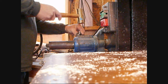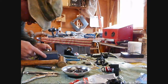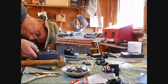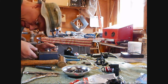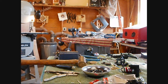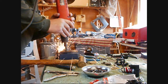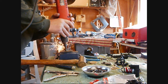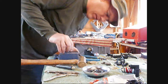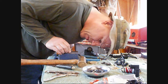If you were to drill it too large there's no friction — it's got to be slightly undersized. This is a number six tapping bit. That works — using the brass hammer so it won't damage the pin. At this point I can still nip this one off and keep going with it. Nip it off. There's just a little bit left, and then see if I can press it in that way. Get out the big Dremel.